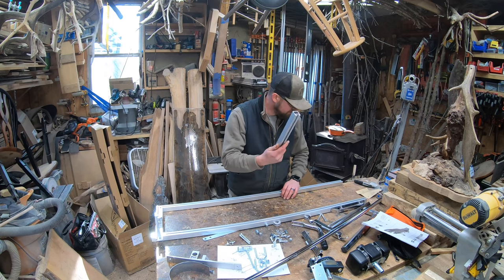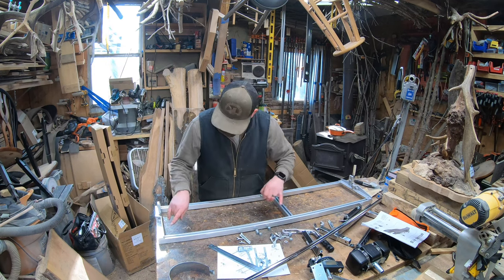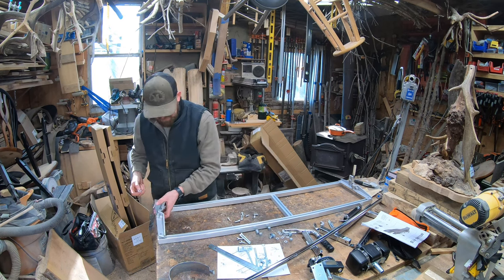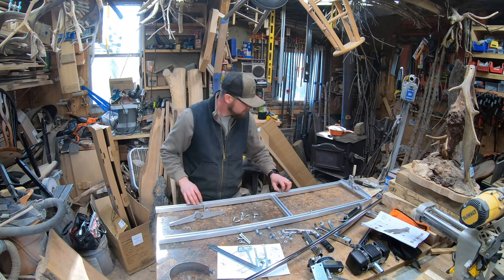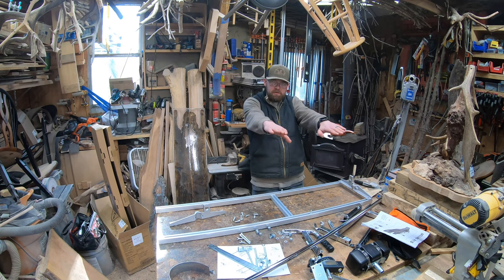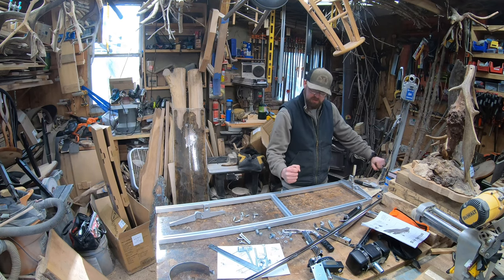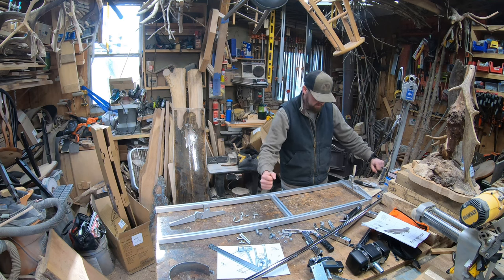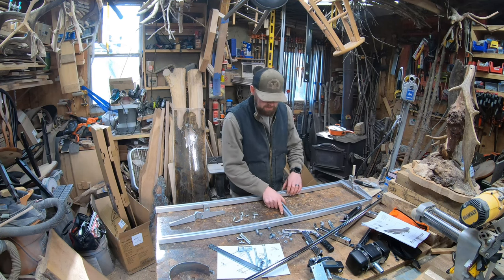I'm taking this post with the rail — all the bars go rail side up. The short carriage bolts tie everything together; you'll need one going down each rail. When putting this together, think about where your saw will be. My saw will be over here with the handle for the throttle, and I'll have a handle here for pushing the mill or cranking. I don't want to be stretched out going down an eight-foot log.